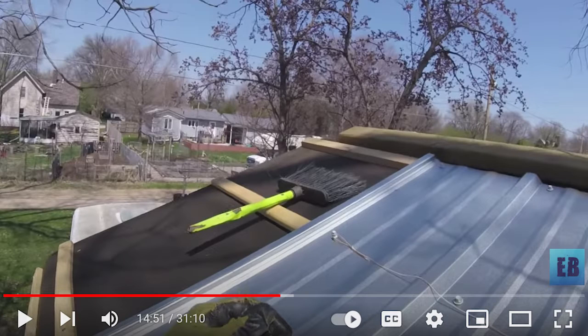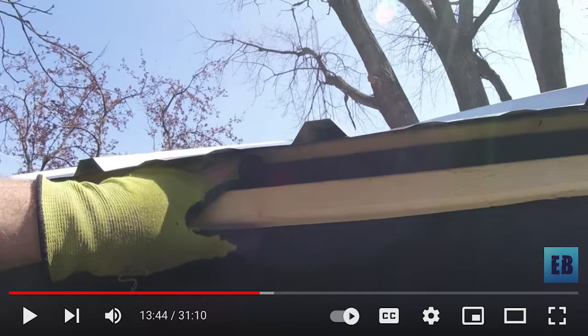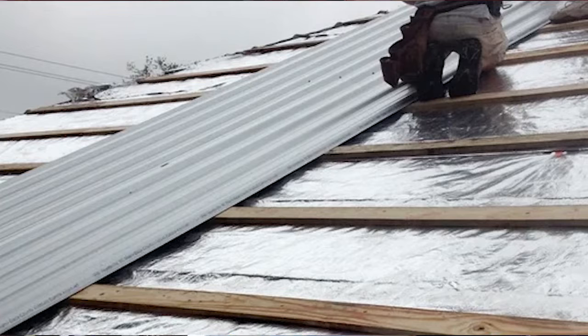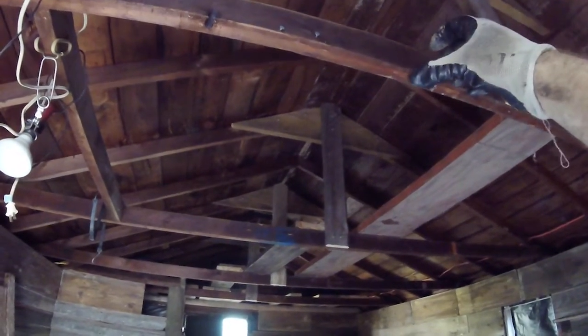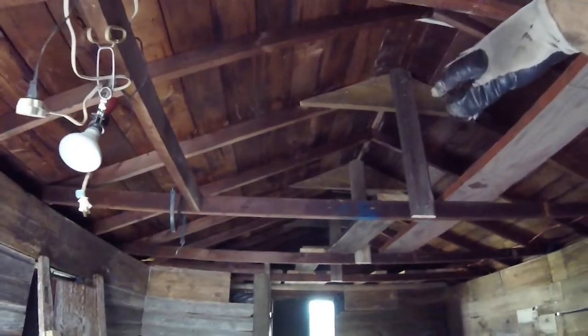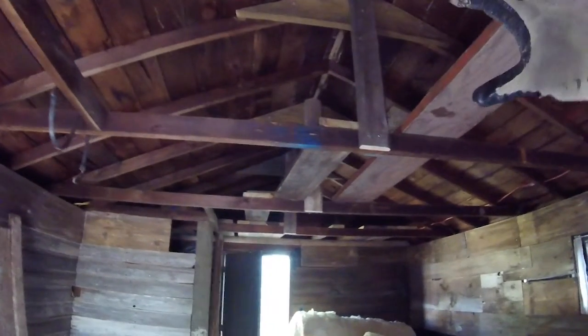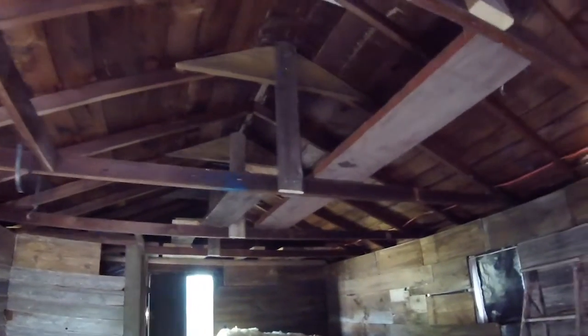On my tiny house shed back there, I could try to find some snapshots of what I did with the metal sheeting on the sides, the paneling. I put a 1x2 strip of wood and did the sheeting on top of that, so there was about an inch gap of air. What that does is act as a heat shield, and I've seen some people do that with roofs. When they put a metal roof on top, they basically put some ribs, a 1x2 or 1x4, and screw the metal sheeting on top of that. That does wonders for keeping the heat out. In my shed, it's always 10 degrees cooler in there. It prevents the heat conductivity, and especially if there's a little bit of airflow through that 1-inch air gap, it just makes all the difference.